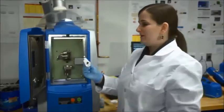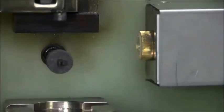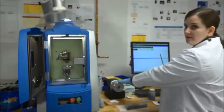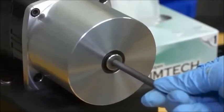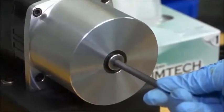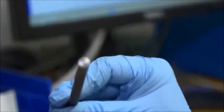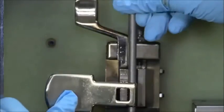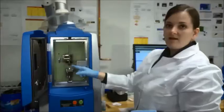I'm going to use another clean chem wipe and get a disc — use a new disc for every burn — and push it onto the shaft. Then the rod: I'm going to sharpen it with the sharpener. You'll see that you get a nice angle and shine on the tip. I'm going to push this lever up and gently rest the rod on the disc, and then when I push the lever down, it sets my gap.